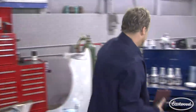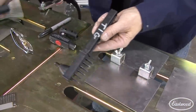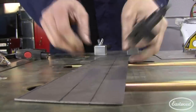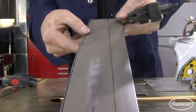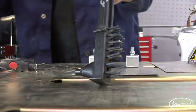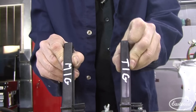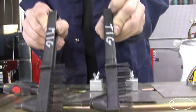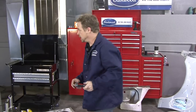Eastwood welders come with these brushes — they're a great tool to have around. I've got one labeled MIG and one labeled TIG. You can take your work surface and quickly abrade through to get rid of any scale or contamination. The reason I keep them labeled is that when TIG welding, you want to keep your TIG supplies separate. Cross-contamination makes TIG more sensitive. Just like keeping a dedicated grinding wheel for your tungsten, keep the TIG brush separate and never use it for MIG work.